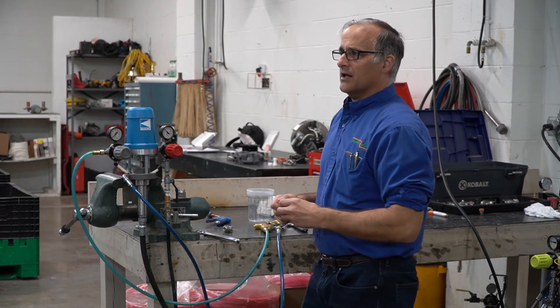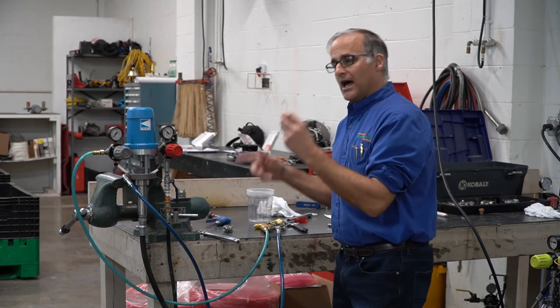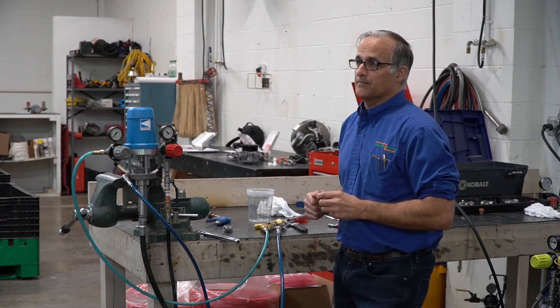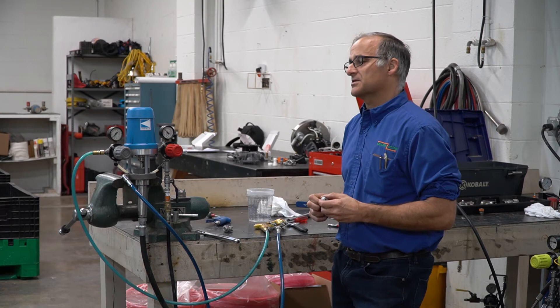So if you're not sure that the paint is too thick, have them flip in solvent or water and run the pump that way. That's the first thing I always do if I'm suspicious that it's thick paint.